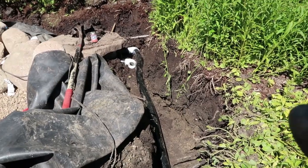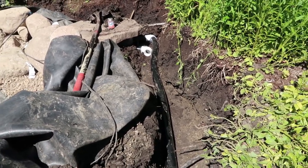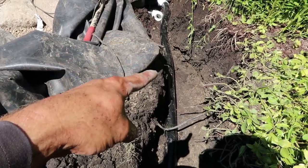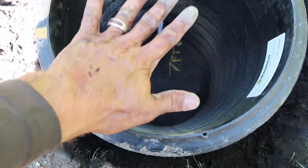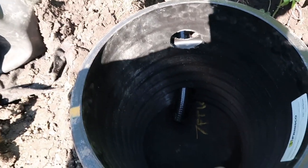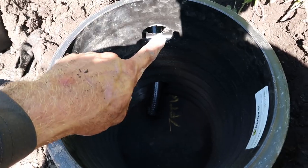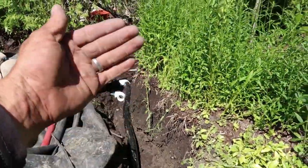So in the event that this pond ever overfills, it will hit that overflow elbow inside the skimmer. That water will, by gravity, be fed through this two-inch line down to the bottom of this pit, fill up this pit, initiating the float switch on the sump pump, and then the sump pump will engage and discharge the water out through that hole — with an inch and a half line running out that way — and then it snakes down and goes around to the front of the property.